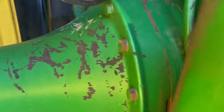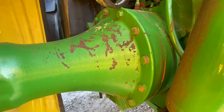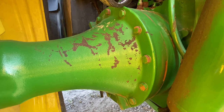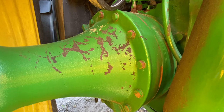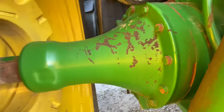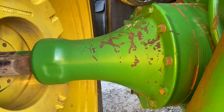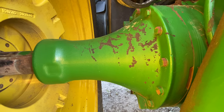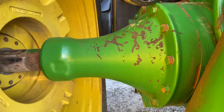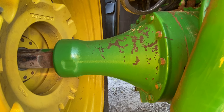Then, when you come around to the back, this is the image right here that we need. That particular bolt pattern shows me that it's a 14 bolt. So now I know that I need a 14 bolt, 120 millimeter axle, and all I do is go to my grid, and I don't have to look up part number and worry about it being right or wrong. So that's a simplification of it. It works for us. It's going to work for you.